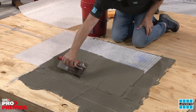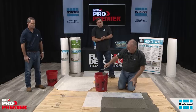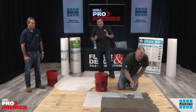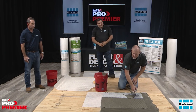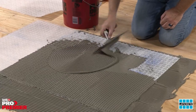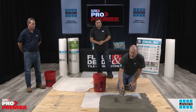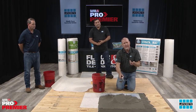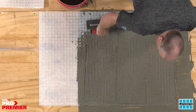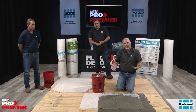Trowel in one direction — that's important because you don't want to trap air. Some guys on job sites might give it a quick skim and then do a swirling trowel motion, which we don't recommend. That swirling motion traps air, whereas running a directional trowel allows air to pop out of the comb area as you put the tile in place. It's very simple to install and very simple to check coverage.